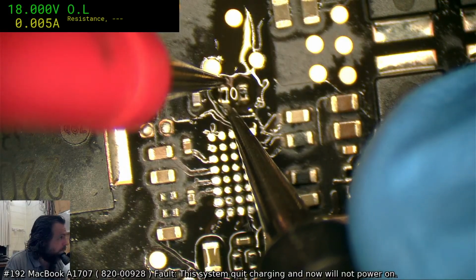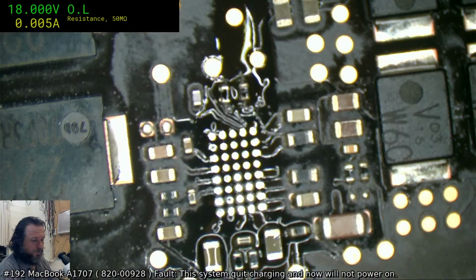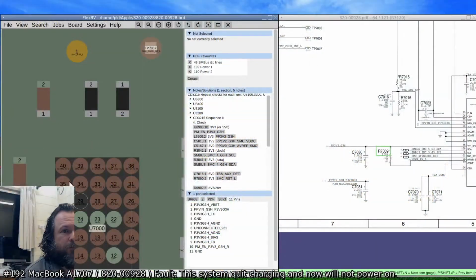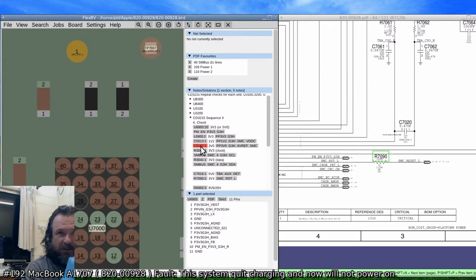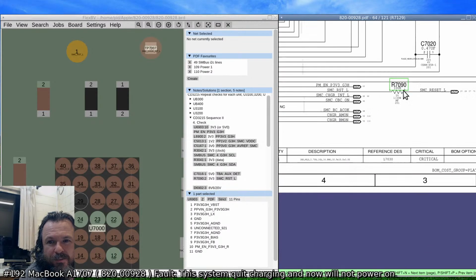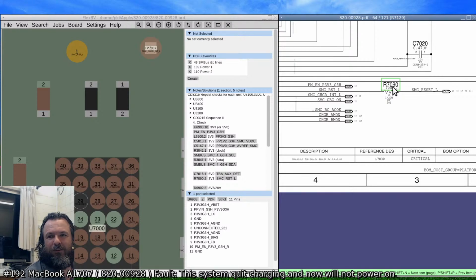Yeah, so I have here a 1K resistor and a 100K resistor, but according to the schematic they're supposed to both be 100K, but they're not. Like this here, 70, 90, 100K, but on here it's 1K. But I believe the value is probably correct, and it's not really a problematic thing. If this is 1K or 100K, it really doesn't matter, because it's like a buffer, a slight sort of fuse just to prevent excessive current going between the two chips.